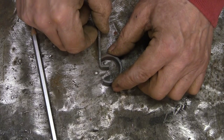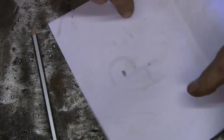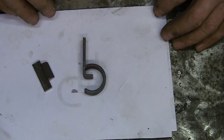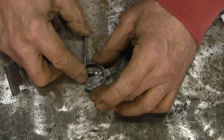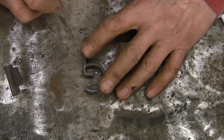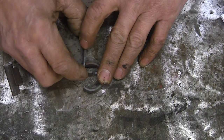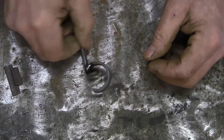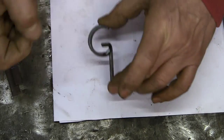I don't need to do it upside down, I can do it the right way up, because I am going to tack it both sides. So it doesn't really matter - the bottom side is going to be ground off, but the top side I can do however I like. Just put it back on this bit of paper, it shows much better. Alright, so that is roughly how I want it. Actually, I can't do it on the paper because I won't get an earth. Sorry, you are going to have to look at it on the bench. I am feeling as rough as a badger's arse today - I have got a cold, I have got a cough, and it is making me harder thinking. That is going to tack there - just a quick little tack. Doesn't need to be much because I am going to tack it underneath as well. There is a little spot of weld in there.